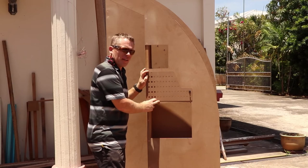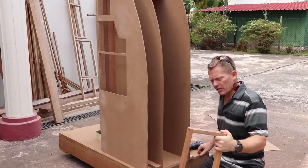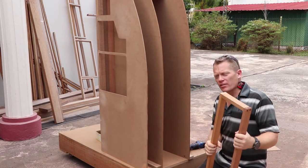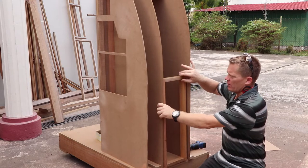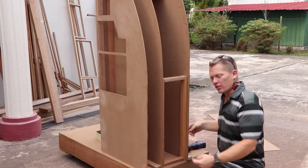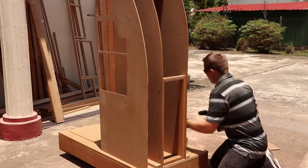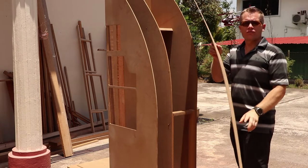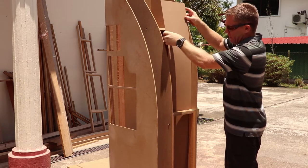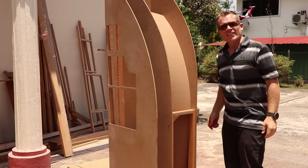With the CB panel complete, let's get this internal skin done. We've created this simple box frame and the inner skin will attach to this and that just sits in this gap here. 13mm back from the edge on both sides and we'll just screw it from both sides for security. This piece of 3mm MDF should in theory slide down the inside and create the internal skin.